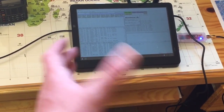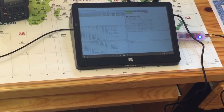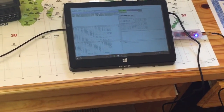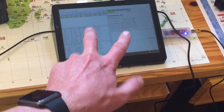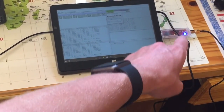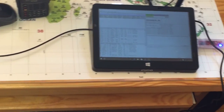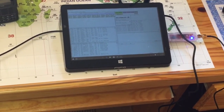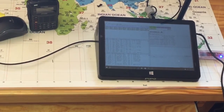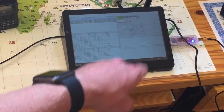So again, physical hardware that you would need? There's some new bridging technology — some will be at the repeater in the future. But to get into it, I like to have the WIRES-X box. As of right now, somebody can buy a DV4 Mini, install just that program on your own, and use other people's bridges like mine. You do not need to run both to get into the system. You would need a fusion-compatible radio — whether it's a handheld or a mobile radio — a computer, and a DV4 Mini.